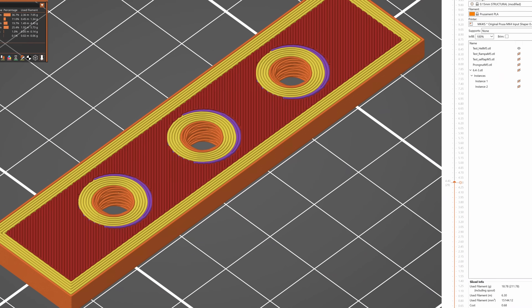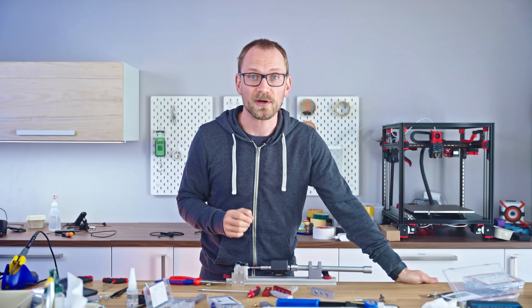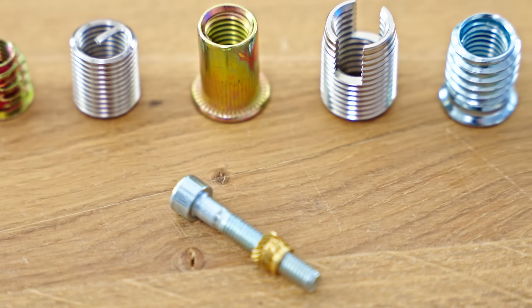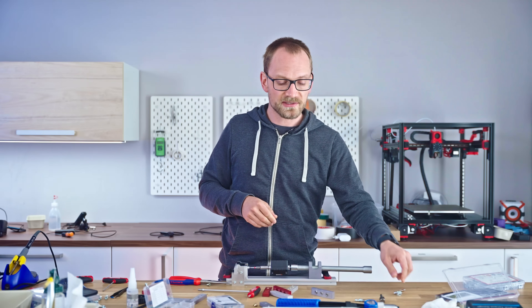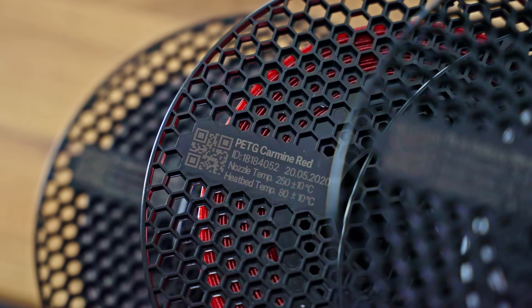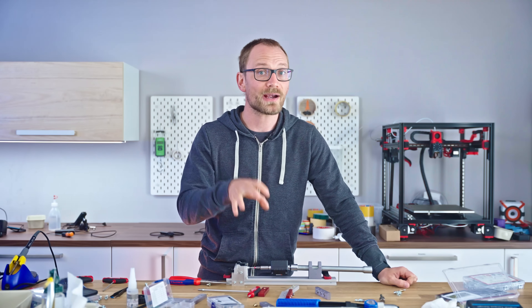First, was it using enough infill and shell thickness, and where is that crossover point where adding more material to your part is just extra weight that doesn't make the connection point any stronger? Then, what about inserts that maybe aren't meant to be used for 3D printed parts — woodworking inserts, thread repair kits, rivnuts, prong nuts? We'll test those. And lastly, do the results that we get with PLA transfer over to other materials as well? I grabbed the best types of inserts and retested them in PETG and Polycarbonate. I've already done all the tests at this point, and the results are actually super helpful in understanding how these inserts work and how they interact with the printed part.